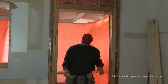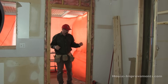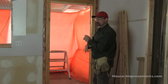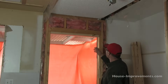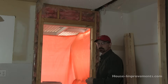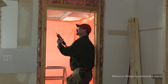Now for the opening, what I need to have is I want to add a stud on each side. That's simply so that I have some place to attach the new plywood on the outside up against the old. And in this case, I've got two studs in the center that are going to be lined up with the ones above. The reason I try to line them up is so that when we're hanging drywall or whatever we've got to do on this side of the room, those studs — if I line up with what's existing — should end up still being on the 16-inch center or two-foot centers or whatever this house was laid out at. Obviously it was 16-inch centers by looking at that. So that's the reason I try to make sure they line up so that you can find them when you're trying to hit them to hang drywall or cabinets or whatever you're doing.